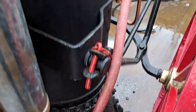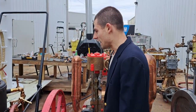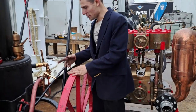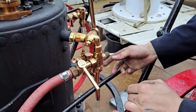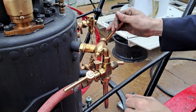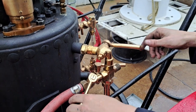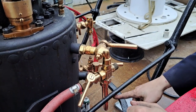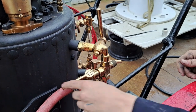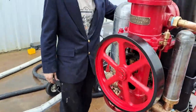The boiler is built really interestingly too — you can unbolt the entire thing. You undo the bolts there and there, copper gaskets, and the whole thing comes apart, so it's very easy to rebuild. It's a bit like a Sentinel boiler, not in internal arrangement but in the way it comes apart. We also have this very nice injector on here. Someone might be able to tell me — Greg Simpson thinks it's an original Merryweather, but it sort of looks like a Gresham. I don't know if Gresham copied Merryweather, but it's a lifter. It starts up quite nicely, mostly due to the short pipework — steam valves right on top of it, the discharge doesn't have far to go. I like this thing — very nice self-contained power package.